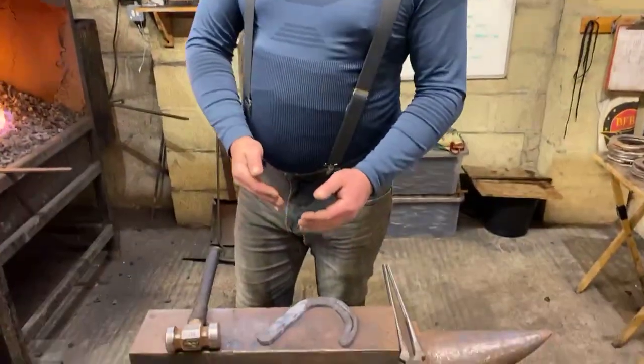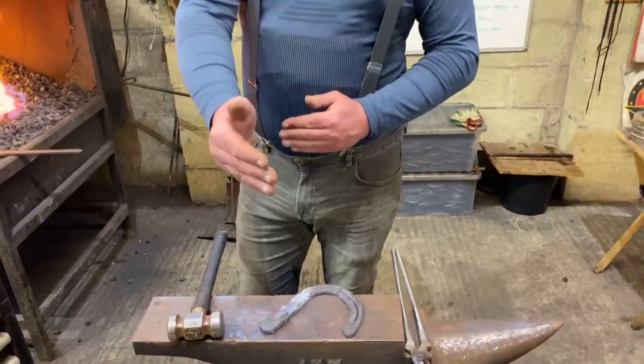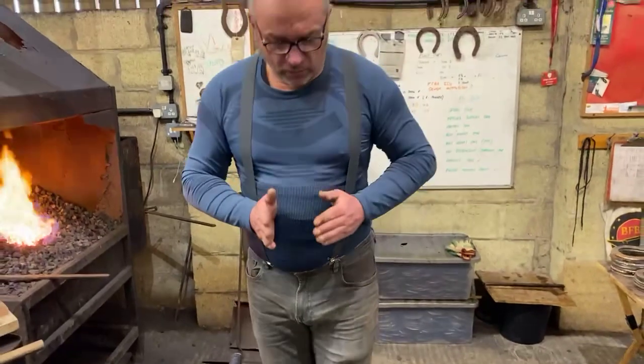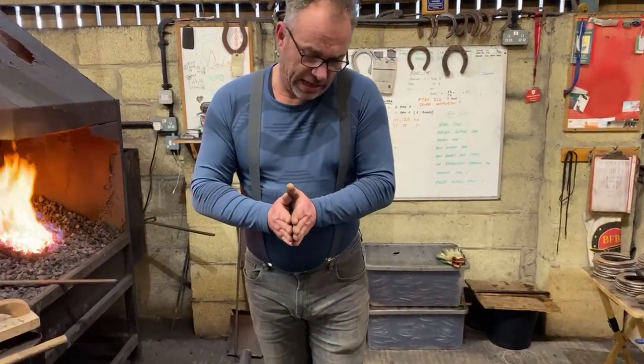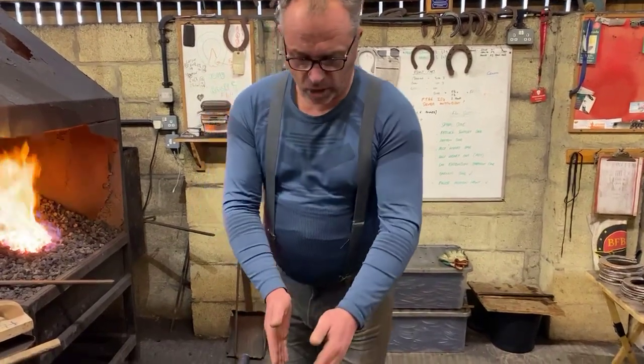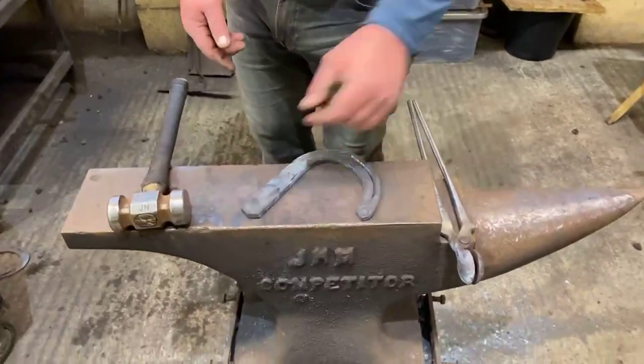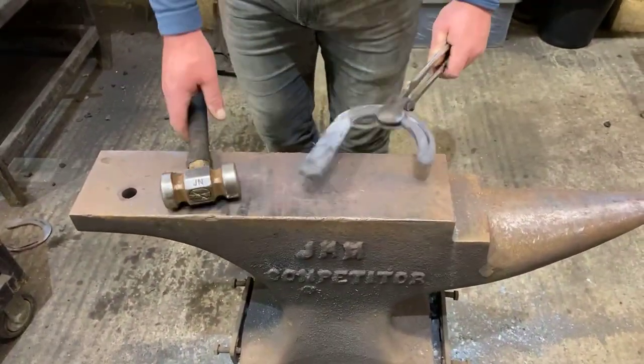That's really, really important. Sometimes you see lateral heel extensions where they cut straight through the quarter and then flick on at the end. That won't fit the foot, and it will not do anything for that foot. So it's important that our quarter goes in earlier. From that quarter, the shoe's a lot straighter to where it fits the heel. That's to give you that gradual, you come out of the outside quarter and you stay out. Hence why we put the extra material on the inside border of the shoe. Okay?